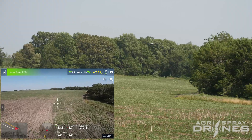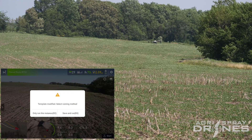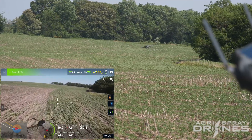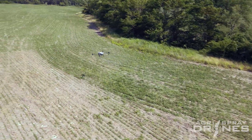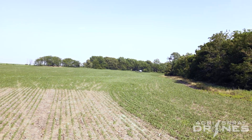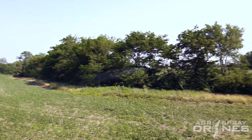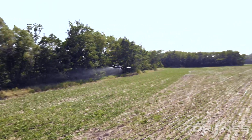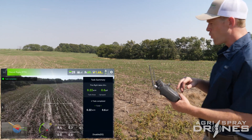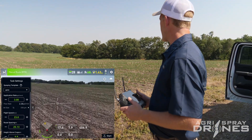It's right here. Hard to see from the camera but there are quite a few weeds in there. Once I hit save and run, it's going to lower down to the 9.8 feet we set and hold that altitude. All I do is push forward on the right stick and it's going to run that pump — there, it's spraying. I let go and it comes to a stop and stops spraying. Now I want to do one more pass — I click that button, it goes one pass to the right, flips around, and I push forward again. It starts spraying, holding altitude, holding speed, making sure it's only putting on three gallons per acre. Really, really useful tool. That takes care of that area of weeds. If you wanted another area, just hit disable and hit start again.